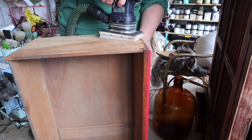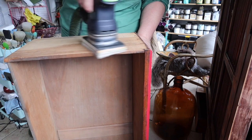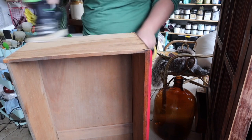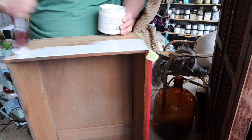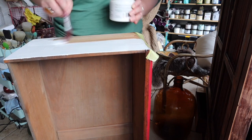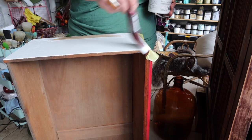While the top and sides are drying I'm going to add some peekaboo drawer detail with Dixie Belle's decoupage paper. To prep for that I'm going to sand the drawer side so it's smooth — these were cleaned at the same time as the rest of the piece with Dixie Belle's White Lightning, rinsed, and are thoroughly dry. I'm just giving it a light sand to make sure it's nice and smooth, then I'm going to paint a base colour of Salt Water, which is also from the silk mineral paint range. I always use white underneath decoupage, especially with rice paper, tissue paper, or paper napkins, because they can be a little see-through. Painting white underneath makes the colours appear truer and crisper on the decoupage paper.